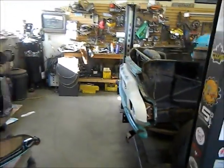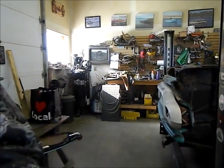So I'll just get you in the stand here. So I've been doing a little bit of research. Can't find a whole lot on YouTube about doing the A-pillars. I found one fella that did the complete with the air boxes and everything. Pretty much totally different than what I'm doing. What I have figured out is I have to repair above the windshield, the inner piece and the outer piece before I do the A-pillars, because the A-pillars overlap on the inside and hold that all together. So I think that'll be my next video.